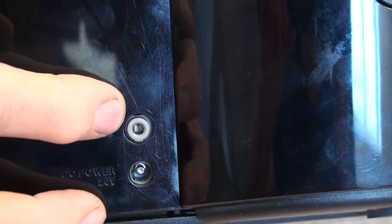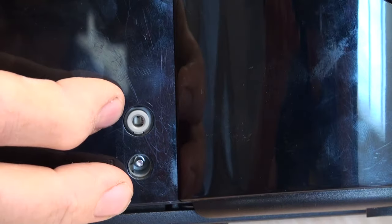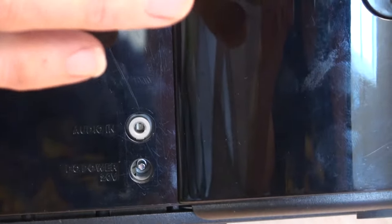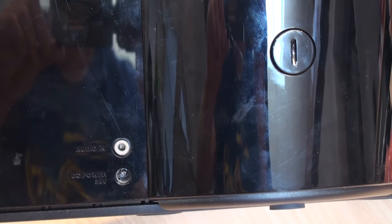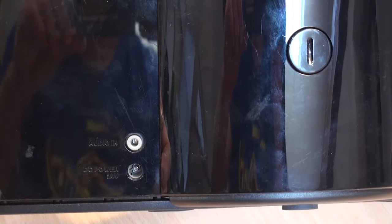Often what happens is the plug gets broken inside there — you yank the lead or something happens and your dock won't play from the aux in, and sometimes it won't play from the iPod dock either. But if it does play from the aux in and the iPod dock is charging your iPod, it could be this board, because this board switches the audio over from the front dock tray where your iPod plugs in and the auxiliary in. If that's damaged, the switch will not work.